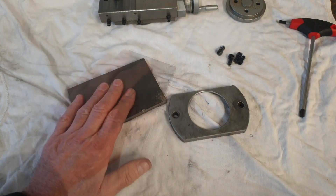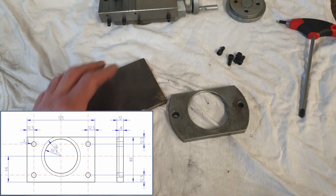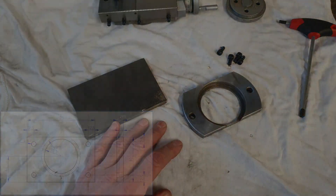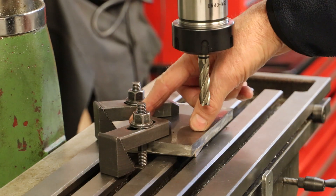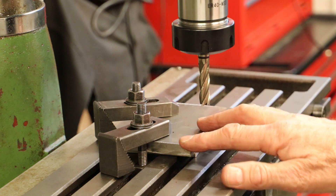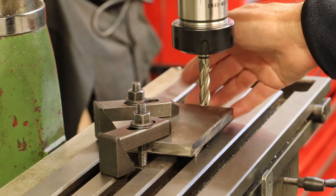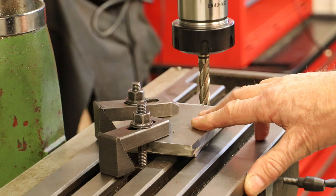To machine the new plate, I'll stick it in the milling machine, square it up, drill the four bolt holes, and then move into the lathe to bore out both the pass-through hole and the clamping hole. This is going to be a really simple milling exercise. I've got about 4mm to take off the width front to back and about 3mm to take off the length left to right. I'll just drop the end mill down, take off a couple of mill off this side, take off a mill or so off the far side, and then reposition the workpiece, square it up and finish off the other two sides.